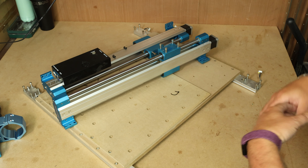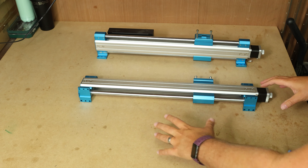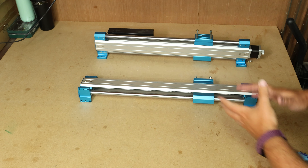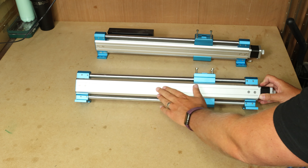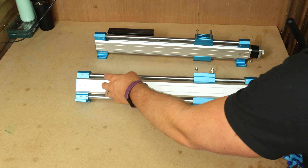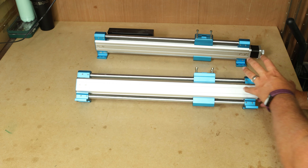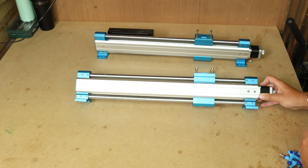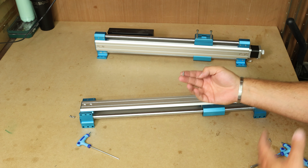The instructions do a very good job of pointing out the bits you need to keep versus the bits you don't, but if you keep everything just to be safe, that's good practice. The disassembly for this is pretty much the same for the left versus the right version and the x-axis — they're all built similarly. First we'll take the dust guards off on either side, then remove the holding plate on the end to release the bars and the lead screw, slide the carriage off, and then release the other end.